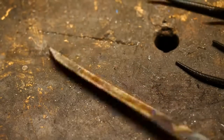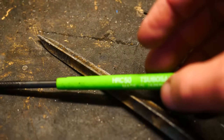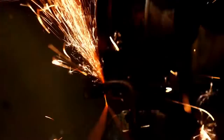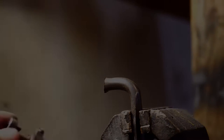And the answer is not really — it's still sort of just over 50, maybe 52 or something like that. So I'm going to cut off the socket and then take it to the anvil, flatten out a piece, and we'll try to do a test run of carburization and see if we can successfully add some carbon.